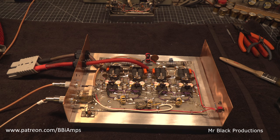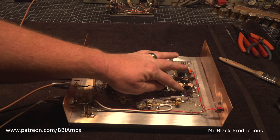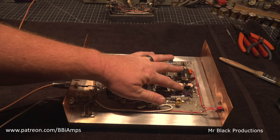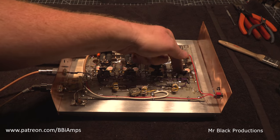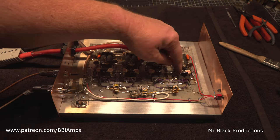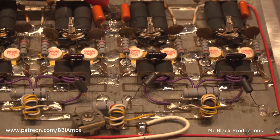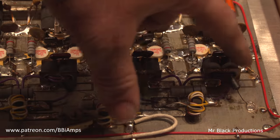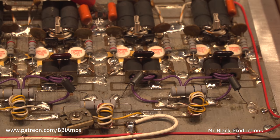Brand new transistor, 4 new caps. Rebuilt the combiner because the mag wire had actually burned in a couple places and was shorting. On this 2-pill section, the transformer was flexing around so much that the trace on this leg of the front of the transformer snapped off. I had to put a piece of solid copper going from the edge of the transformer down to the trace. To prevent that from happening again, I soldered down all the transformers — now they're in there nice and stiff and they'll never move again.